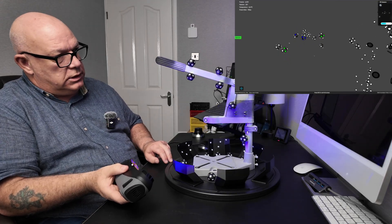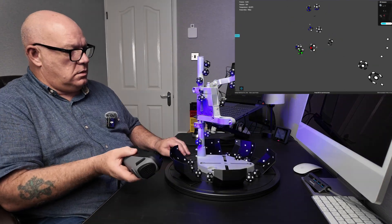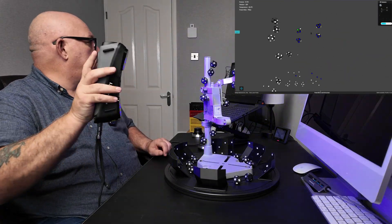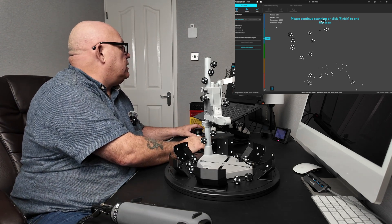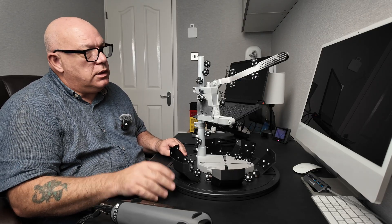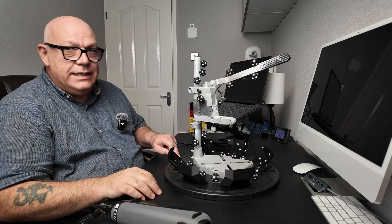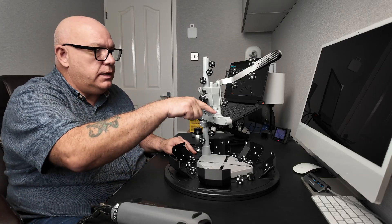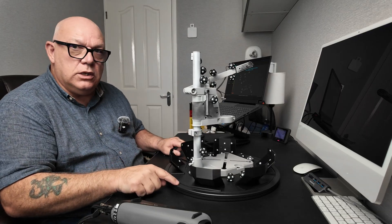Come down at a low angle to get some of those dots underneath. 209 markers — I really must count these one of these days. And the way I'm going to scan this: now that I've done the global marker scan, I'm going to do it in cross lines to start with, get as much in as I can, then probably go on to a single line to try and fill in the little bits that are missing in that bore, around some of these little corners and nooks and crannies.